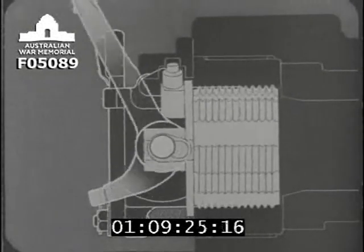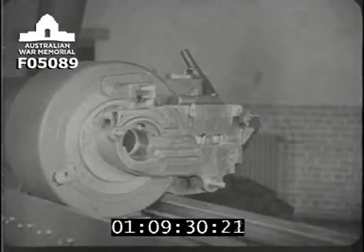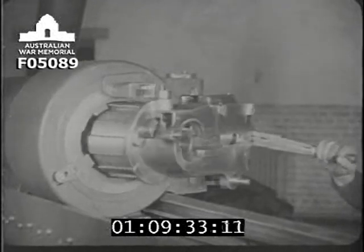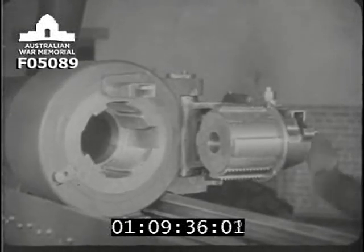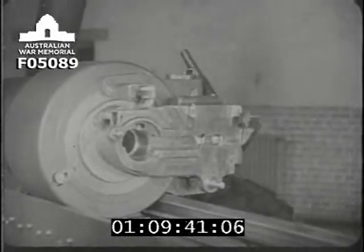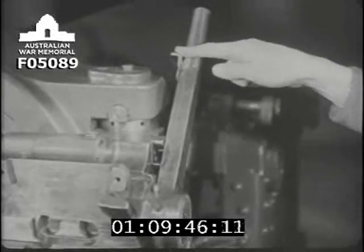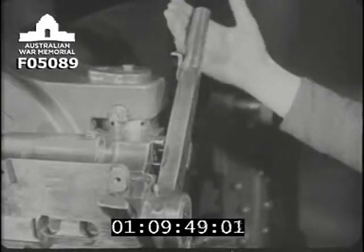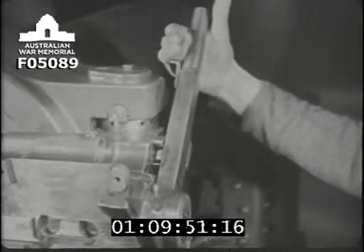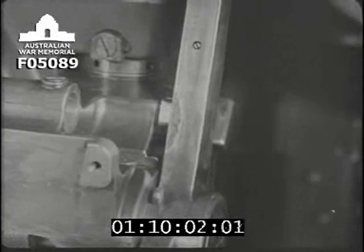Once more, watch the whole locking movement. And now, watch the opening and closing on the gun itself. To prevent the breech from being opened accidentally, there is a catch on the LBM. This catch must be pressed down before the LBM can be pulled back and the breech screw unlocked. Watch how the catch works when the breech is closed.